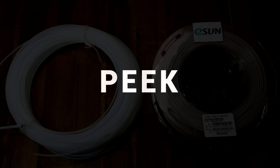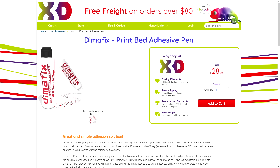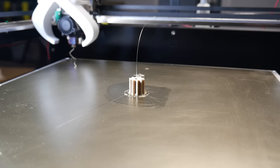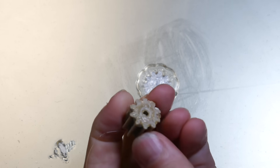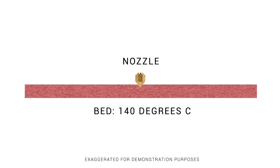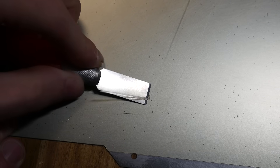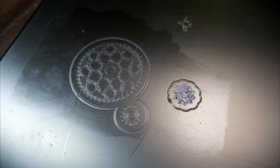One more category: exotic filaments such as PEEK. The thing about PEEK is that it's extremely tough, but needs a nozzle temperature of 400°C. Thinking that PEEK and PEI wouldn't necessarily stick well to each other, I purchased some Dimafix print bed adhesive and applied it to a smooth PEI sheet. I was pleased to find the PEEK stuck quite well — in fact, it stuck a little too well, taking a chunk of PEI with it. This was due to my failure to account for the added thermal expansion of the bed being heated to 140°C, which pushed my first layer far too close. When the Z offset was adjusted to provide suitable clearance, the PEEK peeled off the PEI quite nicely. So with a bed temperature of 140°C and plenty of nozzle clearance, PEI might be quite suitable for PEEK — just be very careful about first-layer nozzle clearance with a hot end this hot.